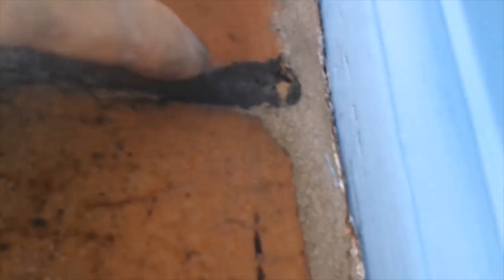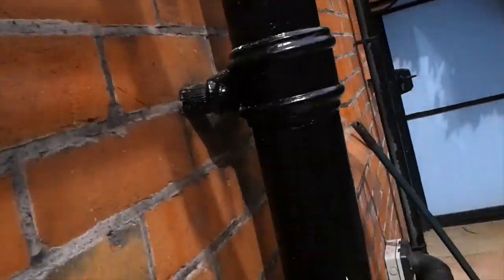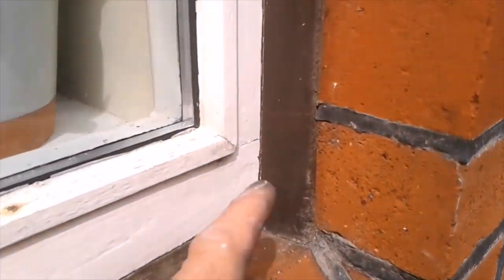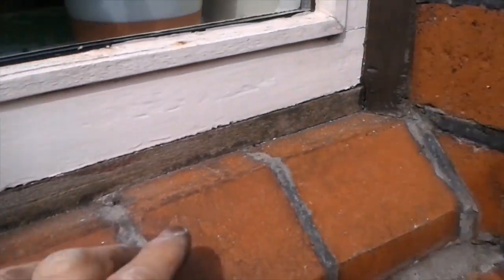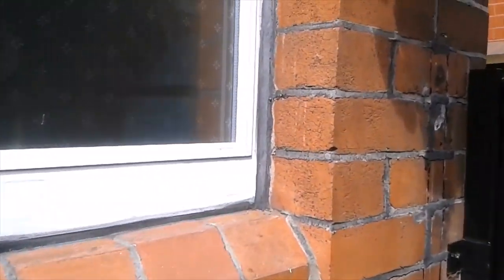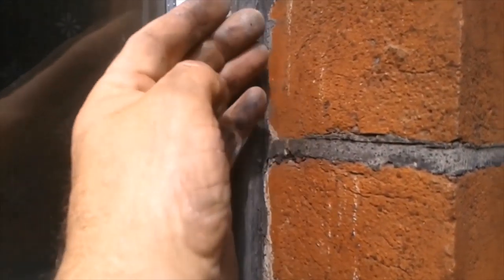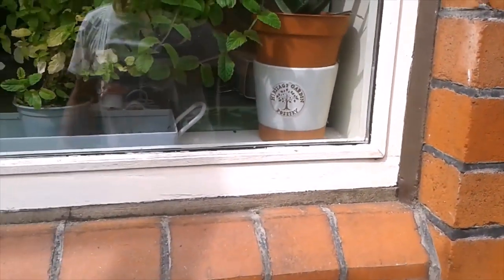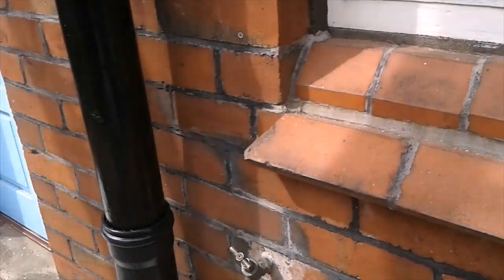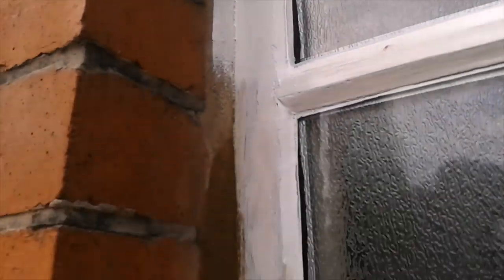A bit mismatched on this side — again there's a big gap there. Looking at these windows, this filleting has been painted brown, more gaps underneath, and this one has been finished black to match with the brickwork and cement. So I will paint this face as well when I do the window and leave that edge — they'll all be looking good. I can quite happily leave this now for a couple of days, probably three days, just to let all this dry out.